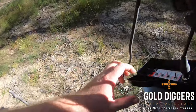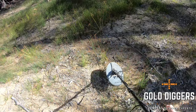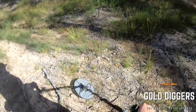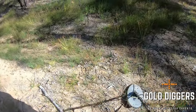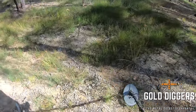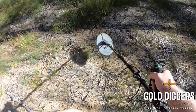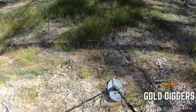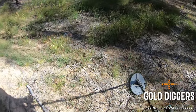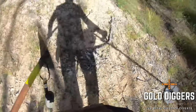The next thing to try is the deep switch on the front of the detector. You can hear the tone has changed a little bit — that's just because of the factory defaults in the deep setting. It's a little bit unsteady, a little moany and groany. And you can hear that target sounds totally different now — it's very broad, and you might mistake that for an EMI spike or even a ground noise. Deep really is just a set of factory presets designed to highlight larger, deeper targets, so you'll tend to miss a lot of these smaller shallower targets.